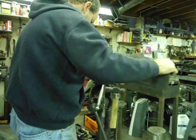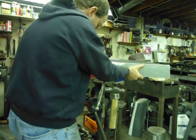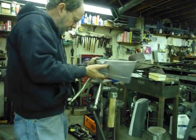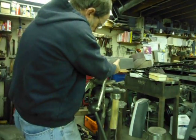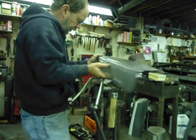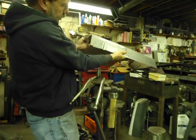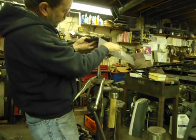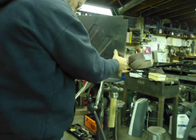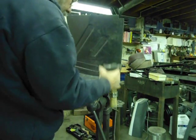What we're going to do here is pull the tuck in there and work our way up as we're doing that, pulling a nice tuck in there. This is going to take quite a bit. Now, as you pull the tuck in, you can see how much this is straightening out, and with the fixture holding everything still for you, you're pretty much guaranteed that that's how much you're going to get.